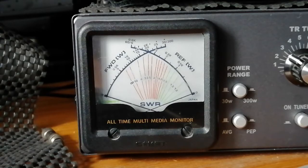It's reported as having a 4-watt output, so let's see what we're actually getting. We're getting less than 3 watts — a tad under 3 watts. We'll repeat that test now on AM. We'll do a dead key to start with and a little bit of modulation just to see if we get any swing. Again, just under 3 watts.